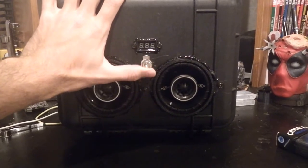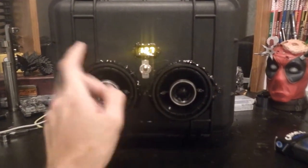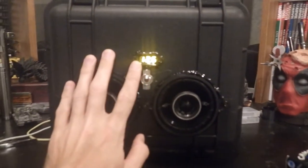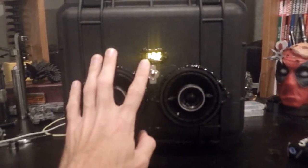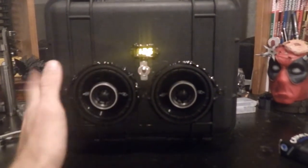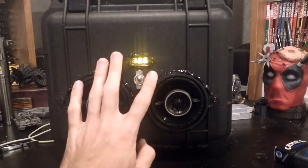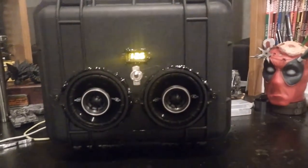I've got my on/off switch here — just a simple toggle switch. I've also put a voltmeter on here. This is my first project, so I'm pretty sure some of you are going, 'oh, that's really off-center,' but I really don't care — first one, gave it a try and it worked. It's reading at 12.6 right now. It reads up to about 12.8 when fully charged and drops to about 8 when needing a charge again. I've had mine on for about eight hours off and on for the past four or five days. Last charged it on Sunday and today's Thursday.